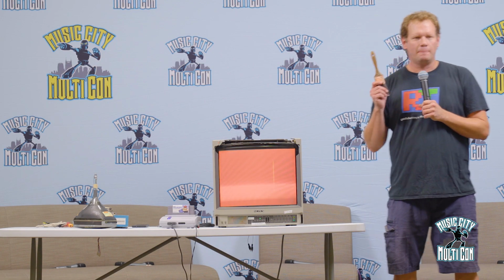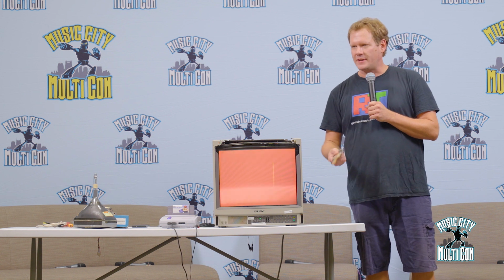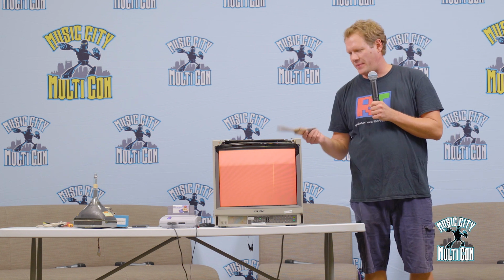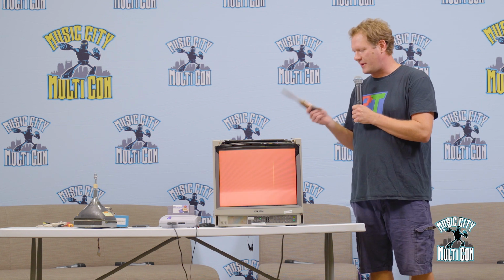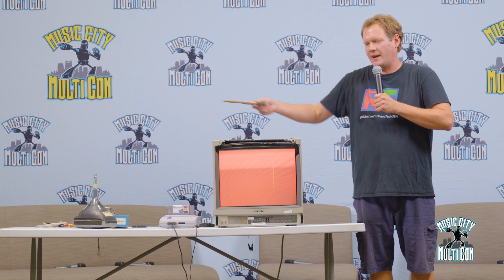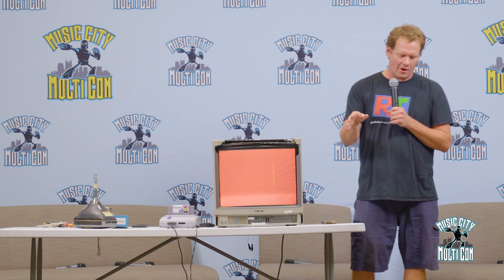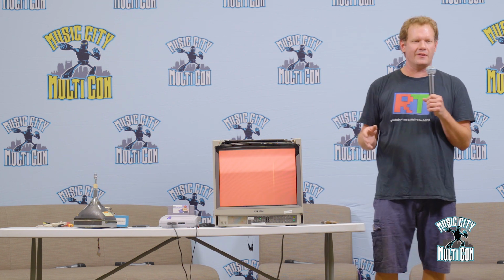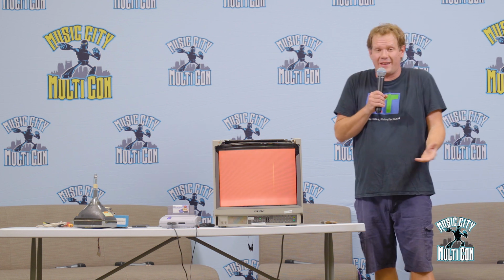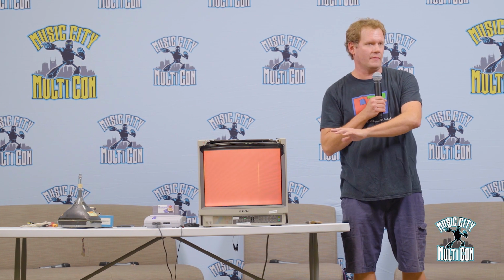Yes, that's a great question. Nowadays you can still find good CRTs if you want to get one from somewhere like Facebook Marketplace where somebody's giving them away locally. And you don't have to invest in a PVM like this. You could start with something that does almost everything this does, and you could get like 85% of the experience of a CRT and get all the great things about it. It's just that, again, the hot rod of a CRT is these higher end monitors. But the home ones always seem to be dirtier because they just sat there, got skin, dust, maybe smoke, maybe everything, settles inside of it for 15 years, and it's never been opened and cleaned. These professional monitors are designed to be serviced, so they were serviced and they were cleaned.